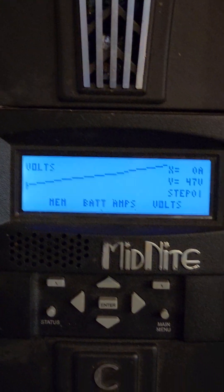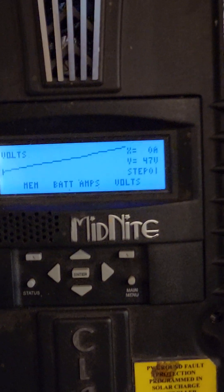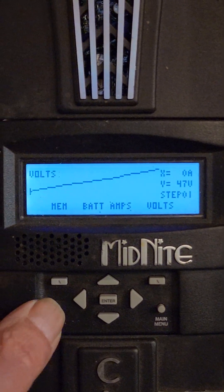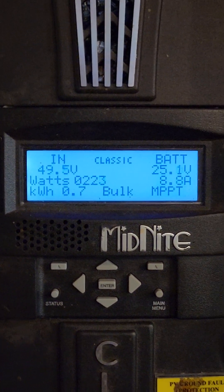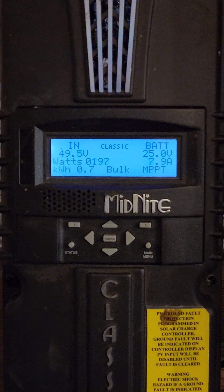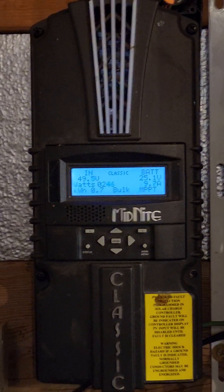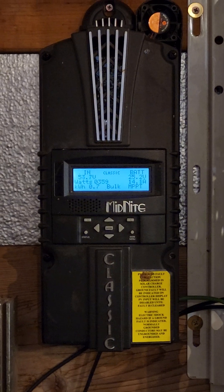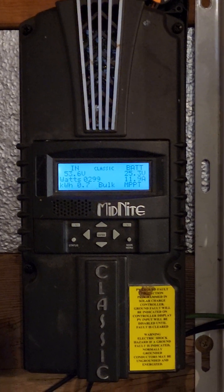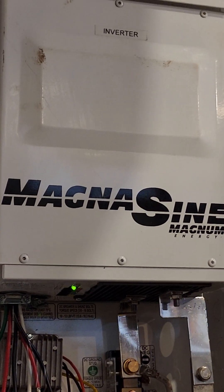Within reason, the Classic won't let you do ridiculous things with the power curve, but it also has some power curves built in already. This whole setup right now is in very experimental, mad-science mode — fairly hacked together. I'm actually running the whole house and shop off the wind turbine and the batteries right now, which is a pretty big load for this little Magnum inverter.